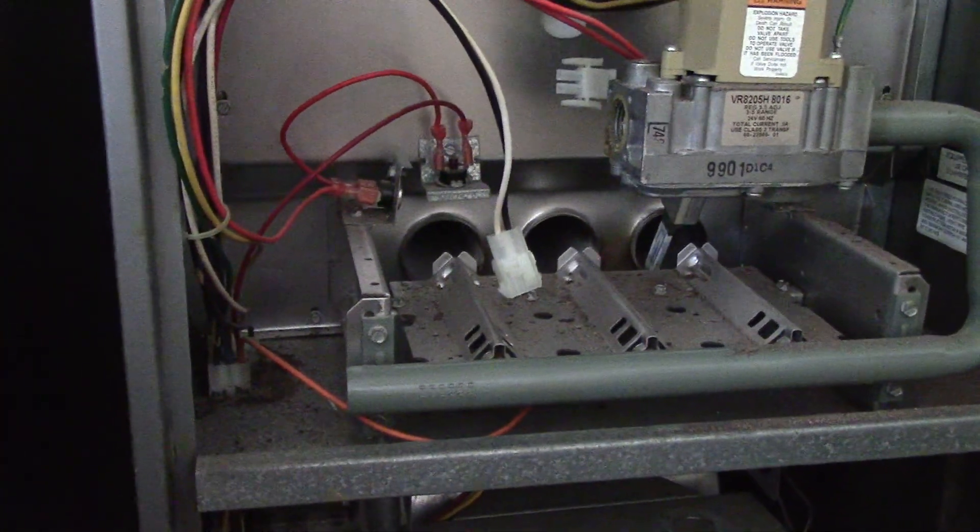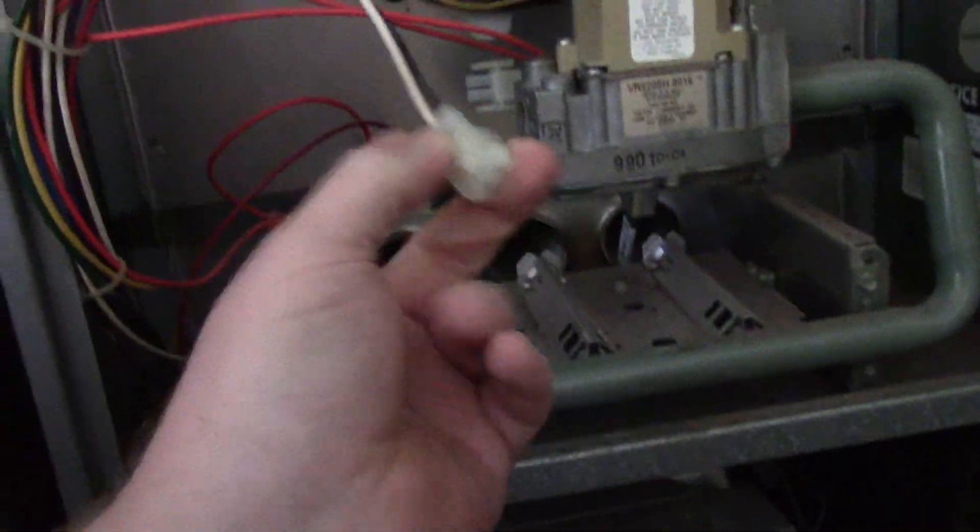I've had students and co-workers get stumped by it, but you have to verify there's voltage here for it to work. If you don't have voltage at the plug for the igniter, don't forget — sometimes wire connections there can become corroded or come loose. See how it just goes through the burner compartment there. Check here, check here, verify it here. If I've got 120 there, I'm done. But if I didn't have it here, I go to the source which is at this plug. Trace it out through the schematic however you need to, and you can figure out which one's the igniter and which one's the inducer. If I have it here but not here, there's something wrong with the wiring. You can ohm out the wires too to verify it on there.